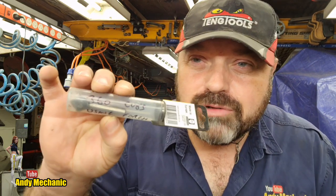I found that when I was using some kind of cutting fluid — this is the Forch drilling and cutting foam, it's really really good by the way and you use hardly any of it, one can lasts for ages — I found it was a lot better. So it started me thinking about how it affects the bit without using the foam compared to using the foam. I saved one of the bits — that's done 240 countersinks, that's the point where it started to lose its edge. Then I switched to a new one and did 360 cuts using the Forch drilling and cutting foam. It adds a little bit more time to the job but it makes a massive difference.